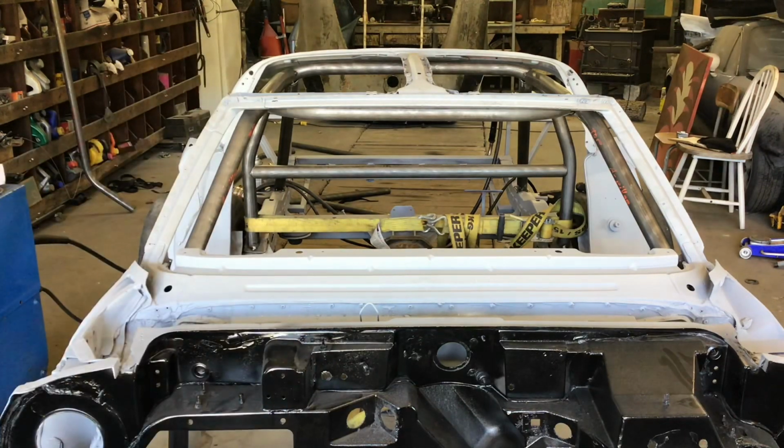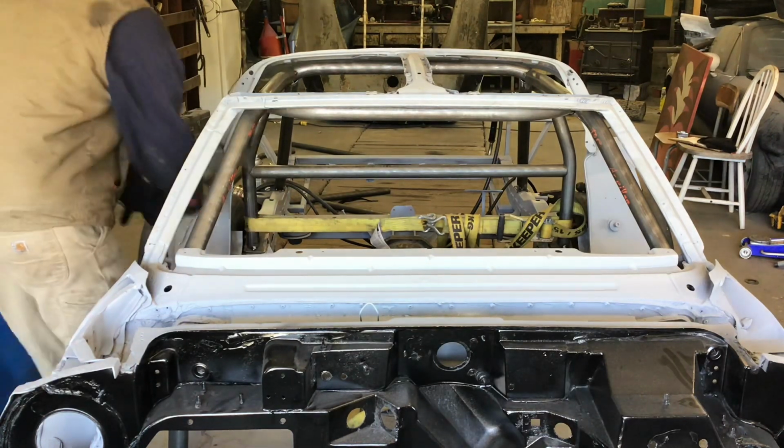This side needs to come up a little bit. Just a hair. Oh yeah, dead nuts. That was the side I just notched with the grinder. Good contact all the way around. And then this is the one. This side was pre-notched by AutoWeld. I'd say they look pretty much the same. I don't know. Boy might be pretty good with that grinder. Let's tack it.